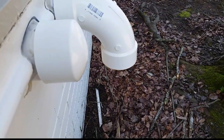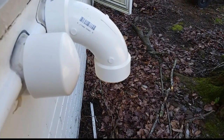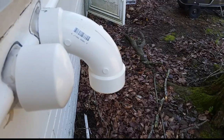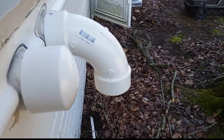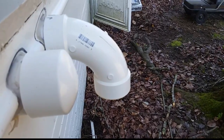Alright, we're back inside the house. I'm going to turn the thermostats on. We've removed the leaving air sensor from the supply duct, and that's going to cause the system to believe the outlet temperature for the heat pump is insufficient — it's going to turn on the gas furnace after about six minutes. It has been six minutes — you can hear the flue, the 95% furnace has fired off. We're going to let it run for a while and monitor the temperature spread. With all three zones open and then some zones closing, we'll watch how high that spread gets, since this installation increases static more than a normal zone system. Hopefully that is all for today as far as our control replacement and modification.